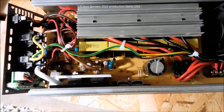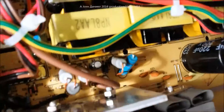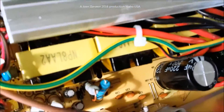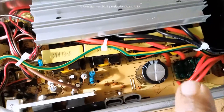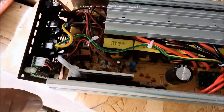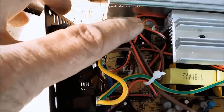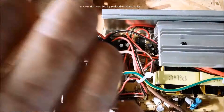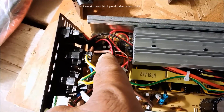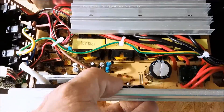This one has a 200 volt capacitor, not a 160 — that's why they don't blow up. I've never had a capacitor fail in one of these, whereas a lot of other inverters will fail. It has standard driver circuitry — pretty basic, not high dollar — however it is the same driver circuitry you'll find in a Samlex, which is a pretty good quality inverter.